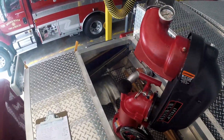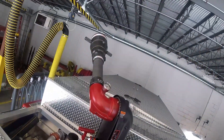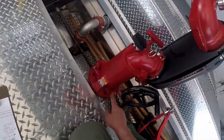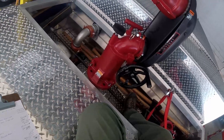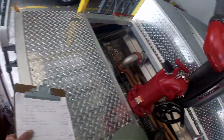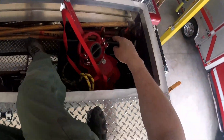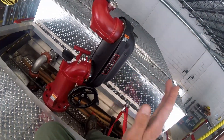Some key notes — kind of some safety stuff for using this. First, power lines: make note of the power lines before you flow water. Second, reiterate these two connector pins — make sure those are both in place. It makes a hell of a situation when those pins aren't fixed and you charge this thing — it will launch. Third, right now we've got it fixed to the truck, but if you unpin this and put it on the portable mount, you cannot flow water with it in the elevated position like that. It's got to be down in the lower position.